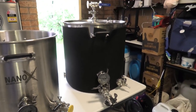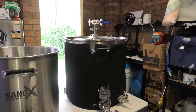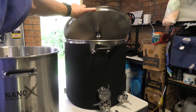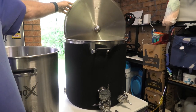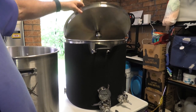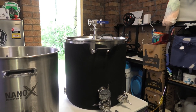The other thing I will mention, in the lid of the mash tun, they have a shower ball. It's quite large, and a shower ball, of course, I don't think will spray as harsh as a spray ball. So when I passivate, I'm going to use the shower ball, and I have a spray ball. I currently have a keg clean system, and I'll use that in the boiler. So we'll put some solution in and go that way.